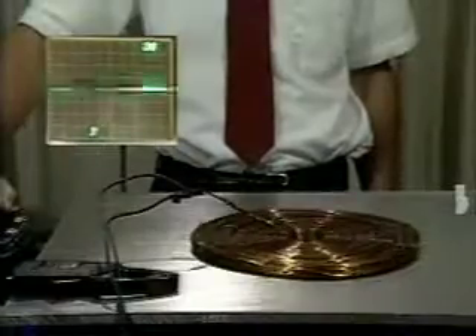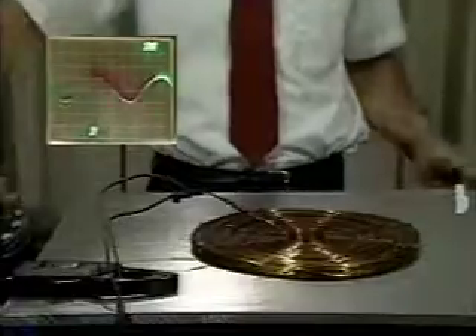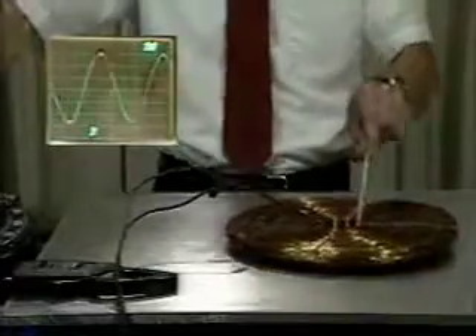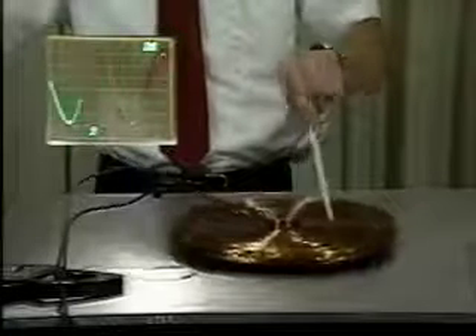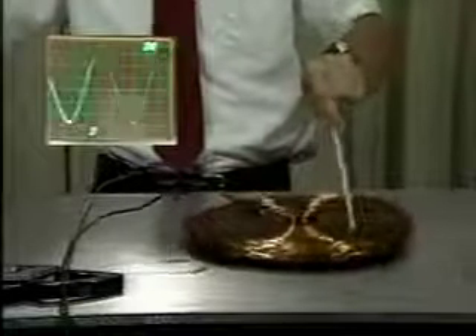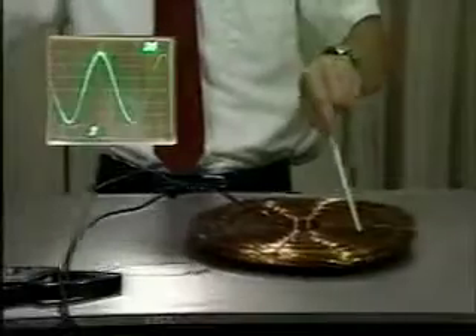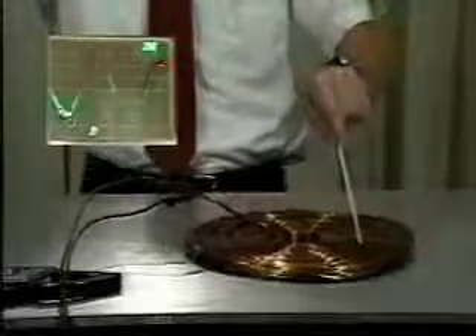The scope trace indicates the coil current. As the current is raised, the force on the conductor results in vibrations which we hear as telltale evidence that the current is being increased. The force is proportional to the square of the 60 Hertz current, and these vibrations result from the 120 Hertz second harmonic component of the force. When the RMS current is large enough that the Lorentz force can overcome the coil weight, the coil lifts off the ground plane. Increasing the current further results in an increase in the levitation force at a given altitude, so the coil rises to make the upward magnetic force equal to the coil weight.